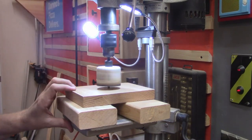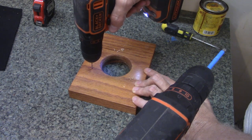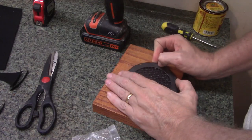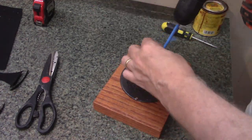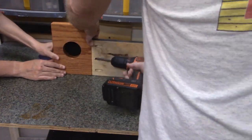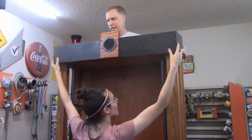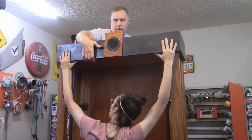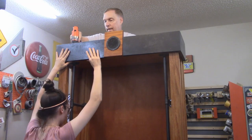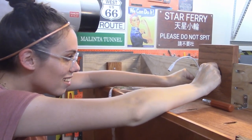The first step to making the centerpiece is to take a scrap piece of oak and drill a hole into it — as big a hole as we could with our circle cutter. The piece was stained and polyed off camera, but here you can see us put pilot holes so we could attach the grate. The sparkly felt behind the grate is going to hide the sensor for the LEDs — it's actually leftover from an old project, the Technodesk, which is my personal favorite project. After the grate is mounted, we pocket screwed on the wings, and now the crown is ready to be mounted. It took a little finagling to get the crown in the correct position, but once we got everything level it attached beautifully and looks amazing.